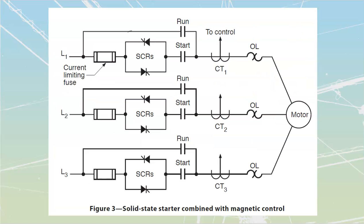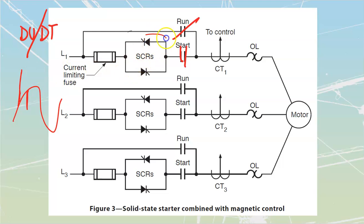The benefit of having a bypass contactor is that once you're actually in run, you're able to isolate and open out the SCR path, so you don't have to worry as much about dV/dt. dV/dt is the change of voltage over change in time, and it's an issue for thyristor-based stuff — SCRs, FETs, and similar components. A regular AC sine wave is fine, but rapid rises or drops and switching transients can be steep enough to shock the SCRs into conduction accidentally. By isolating the SCRs during run, even if there's junk on the system, they can't accidentally gate.